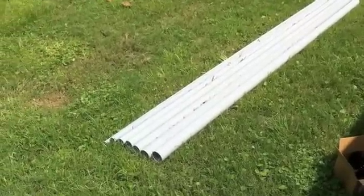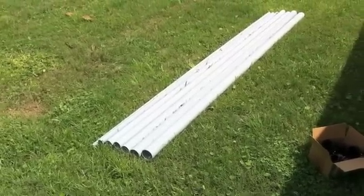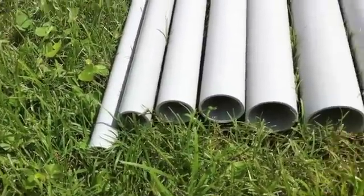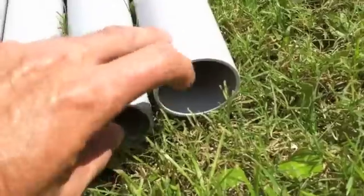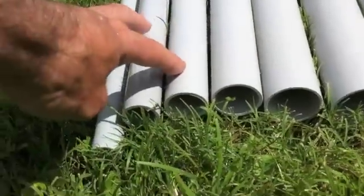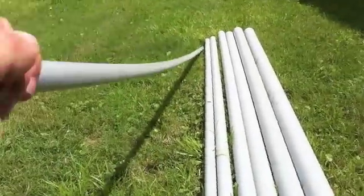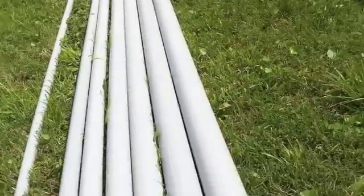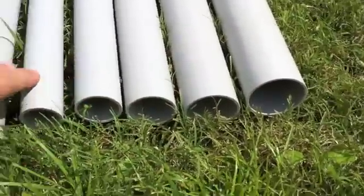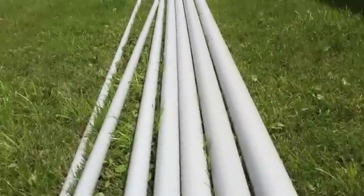Here are the seven pieces for the Max Gain MK8 HD 50-foot heavy-duty push-up mast. The tubes range from two and a half inches all the way down to one inch, with an eighth-inch wall thickness. Measurements are outside diameter: two and a half, two and a quarter, two inch, inch and three-quarter, inch and a half, inch and a quarter, and one inch. It's pretty meaty — the deflection is minimal. I'll probably use the first four or five sections and prep the other two but not go up that high.